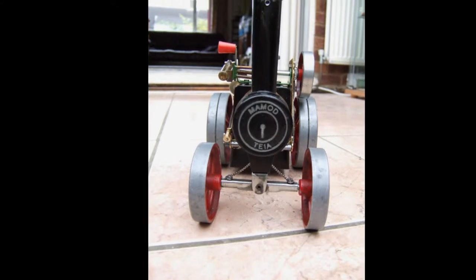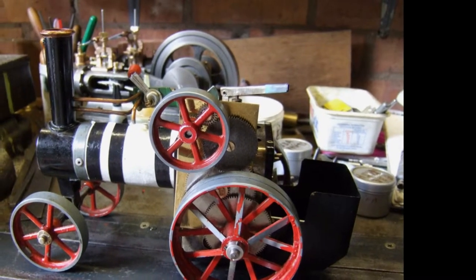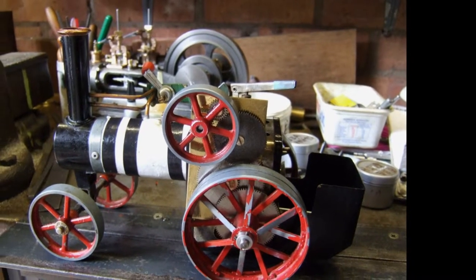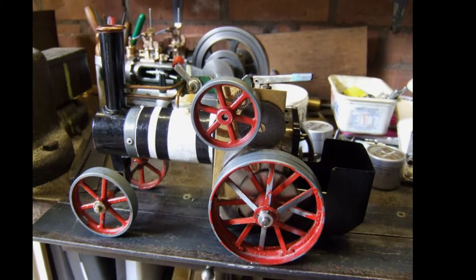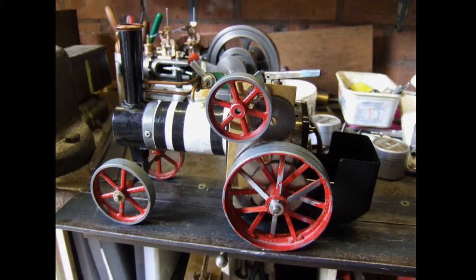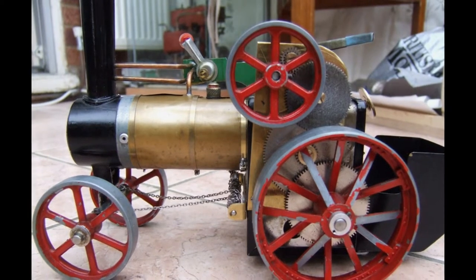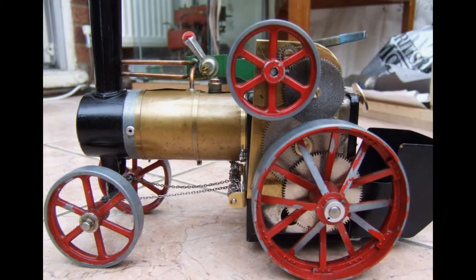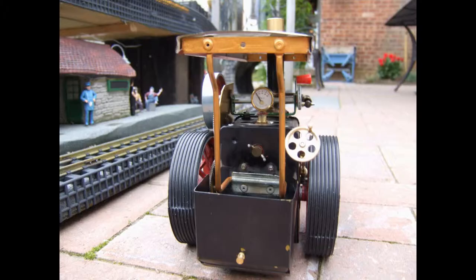One of the things I'd like to mention before I get to the gearing is that I also put a bit of lagging material around the boiler just to retain a little bit of heat, as you can see in this one. This shot shows a bit of brass then wrapped around the boiler to go over the lagging. At one point I also removed the whistle valve and fitted a pressure gauge, though subsequently I removed that and reused it on another little toy I'd made.